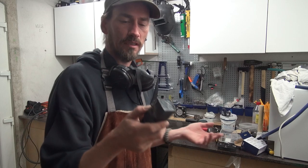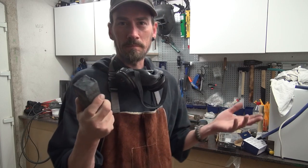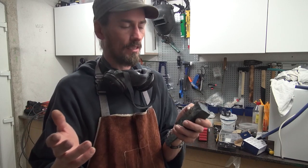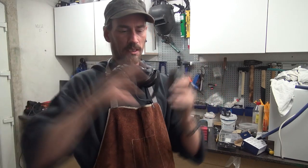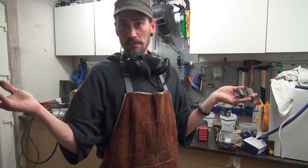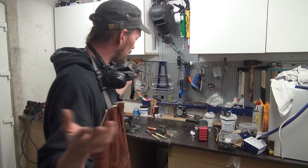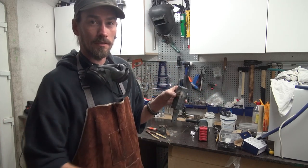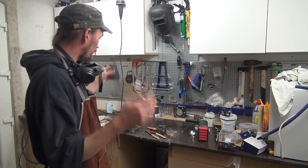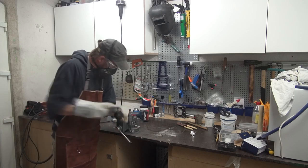On the net, they said it probably wasn't metal that melted out, and I have to agree that it probably wasn't the 440C that melted, or the ball bearings. The question is, was there something else in the steel powder? This wasn't steel powder for forging, but something I got from a Chinese metallurgy supplier, where they make liquid metal, and I don't know if there's some flux stuff in this or whatever. It was a test, just got it off the internet, so we will see what it is and what it isn't, and how much of a fail this is, or how it looks inside compared to the stuff on the bottom of my fire brick in the forge.